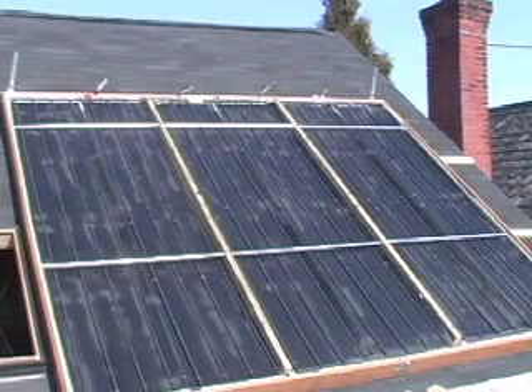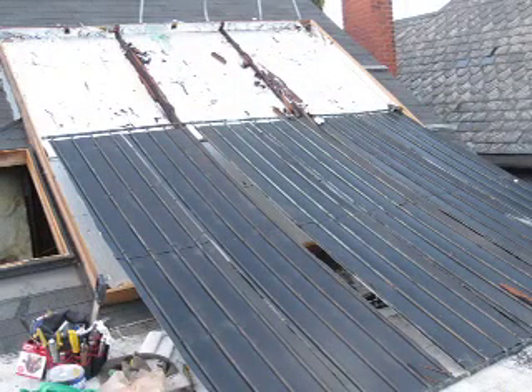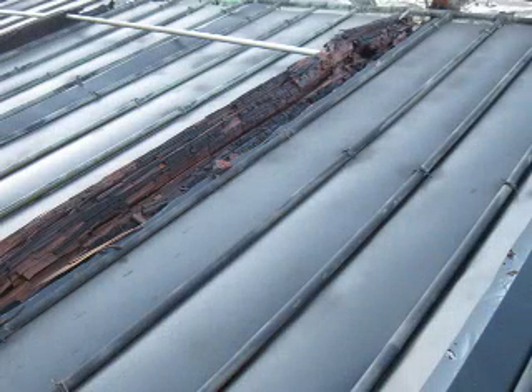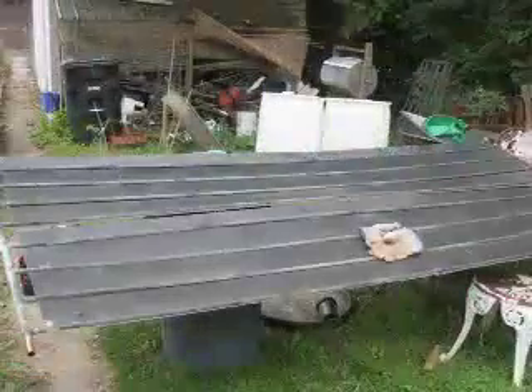Here they are without the plastic on top — the twin-wall polycarbonate — and I'm pulling the cores out. I built these onto the roof and I have to rebuild them, because take a look at this. This is a wooden separator inside, already charred from the heat, just falling apart. So anybody who says you can use plastic in these, I don't think so. This was my thermostat here, and it was underneath a PVC pipe which has just gone away. So I took them into the garden.